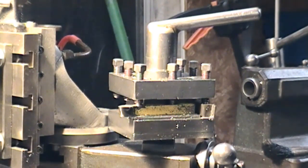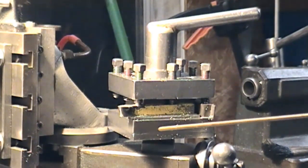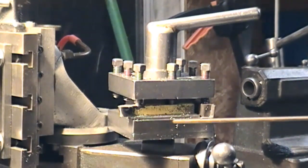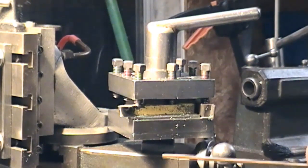For anyone who's followed my project on the four-way toolpost, which I started quite some time ago — we did a video on it which changed part way through as I modified a newly acquired quick-change toolpost. But the actual intention is still to finish my clone of a four-way. This one is milled from solid with a three-quarter vertical space for tooling, though I don't often use much more than three-eighths and a half inch securing bolts all the way around, with a top handle and T-nut underneath.